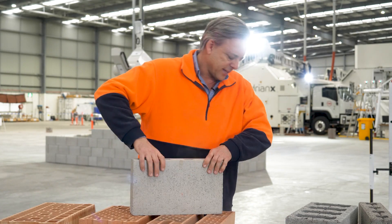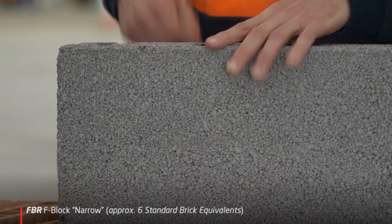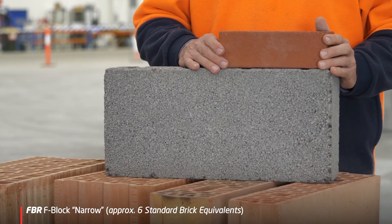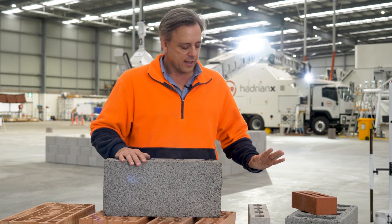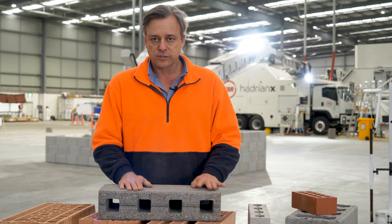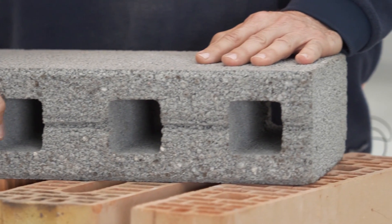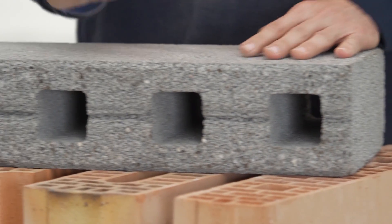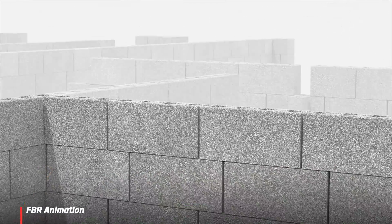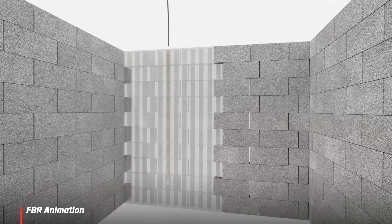In comparison to that heavy block we have our F block. This one is a little bit bigger — it's around six standard brick equivalents. The difference between this and the CMU is that this is made out of a lightweight aggregate which has good thermal properties. It cuts much easier. We have these wide ribs so that when we cut we get a good finish, and we have internal cores which line up in various orientations of the block for your internal services such as electrical and plumbing.